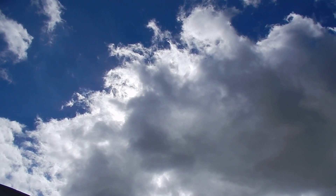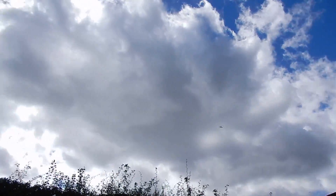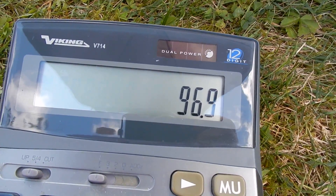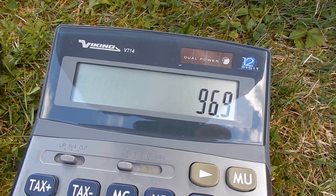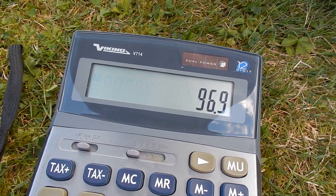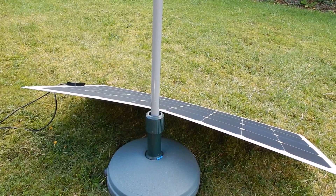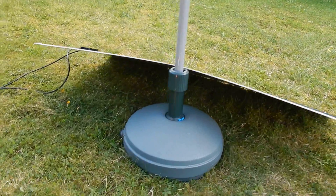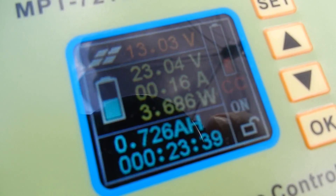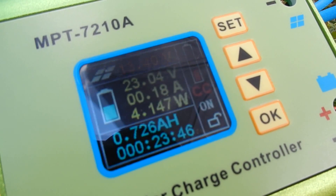The sun's gone in again. Once again the weather has really let me down — we had blue sky but now there's an enormous cloud that will take 10 to 15 minutes to pass. When I had 5.7 amps, assuming 17 volts at the same time — which I think I did — this panel got just about up to 97 watts. That's pretty good for September; we're not going to get the same power as in June. Under the big grey cloud we're getting very little — battery watts are about four or five, and the panel voltage is down to 12 to 13 volts.